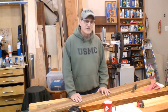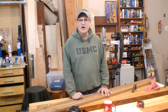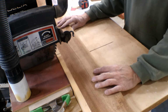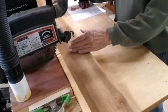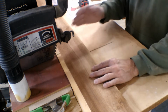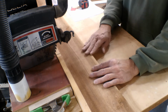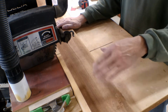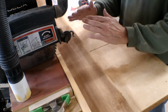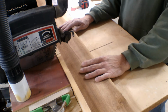I'm going to mark and cut these things out all at once, piece after piece. Makes my job a lot easier. I'm not too worried about the fit. So let's get over to the saw. I don't normally advocate chain marking, where I mark this piece and then mark this piece. But in this case, I've already taken into account the thickness of the blade, so I should be good to go. I'm going to cut these pieces simultaneously, so this is going to be the front and back. These 2 pieces are going to be the sides. After that, I only have to cut the top, 2 pieces for the roof, and the 1 piece for the bottom, and then size those pieces. So let's get started cutting.